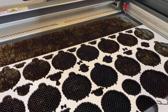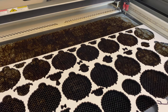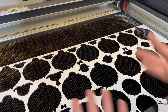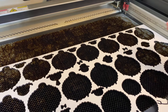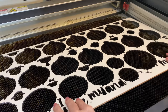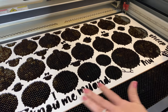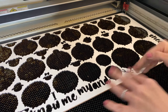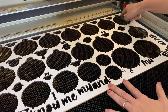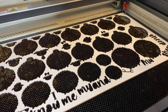It's day two. I have taken all of my pieces out, and I have my jig here. I'm starting from scratch as if I had removed it, which I did — because orders are coming in, I need to add the names and finish and ship them off. I'm going to take my jig, use the metal lip to keep it in place, turn on the machine, go into LightBurn, set the exact coordinates of where I started my origin, and everything should line up properly so I can engrave custom names on these little sheep.